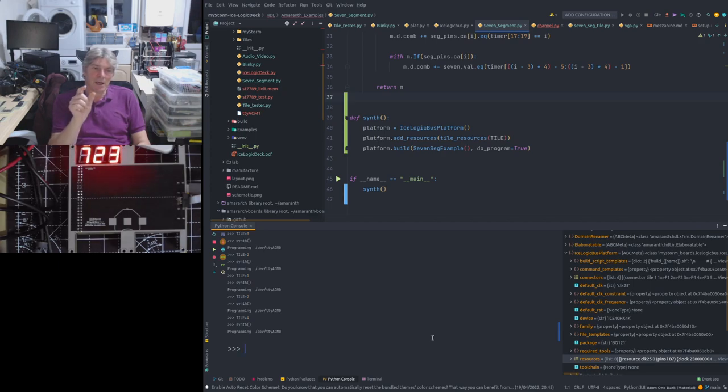I could do a USB device board. I could do a USB-C board, although it couldn't do power delivery, but as a device. And that would include the extra CC pins and the sideband pins, which is nice. And that fits perfectly on one of these in terms of the number of pins and its size. I could put a gyroscope, magnetometer, all of that on there. I could do encoders. I could do sensors, humidity sensors. You could do time of flight sensors. In fact, you could put more than one time of flight sensor on there if you wanted to. So I think it would be an ideal size for those, so I could use those instead of PMODs. And I think that's the way I'm going to go.